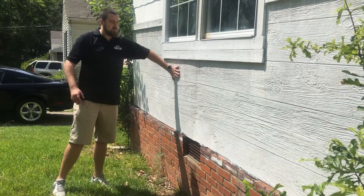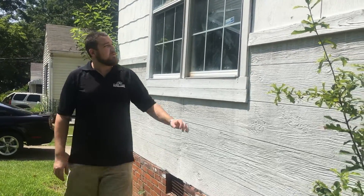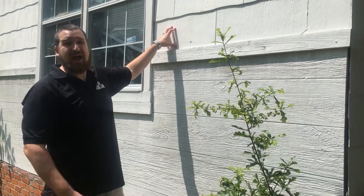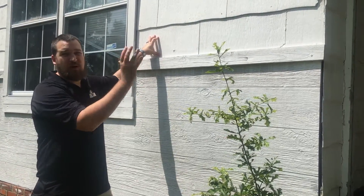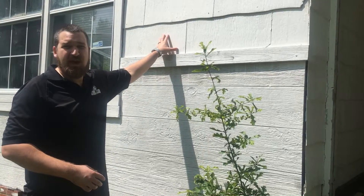So we're probably going to replace this siding — tear off all this siding, put hardy board up, and then use some of this asbestos siding to patch some of the holes and problems on the rest of the house that still have asbestos siding. We'll show you in future videos how to remove this without breaking it, and how to reuse it.